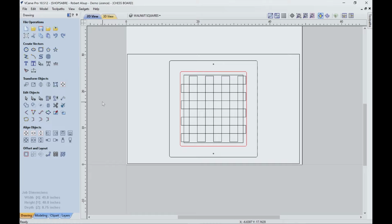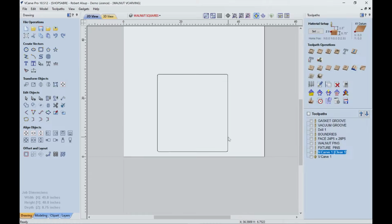All right, now let's look at some more tool pathing. One of the things that I did when I made the fixture board was actually cut a shallow groove in there to tell me where the blank went. And basically this kind of represents that area, because what we're gonna do first is we're gonna take our blank and hopefully it's gonna be held with vacuum. And in our case, it worked quite well. All right, so then our first step is to surface that board.